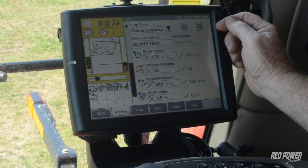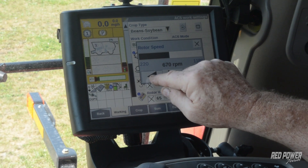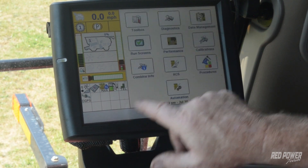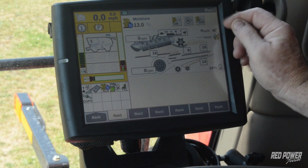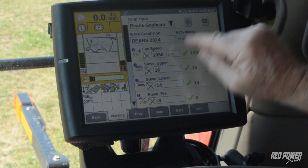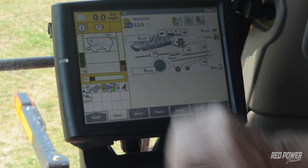This is our settings now for Beans 2024 — every time we shut on and off, this is what it's going to go to. Let's say as we're harvesting along we've decided we've got plenty of rotor speed and we slow it down a little bit — we may want to save that change too. On our run screens there are shortcut buttons up here that if we change something on a setting while harvesting, we can save it right there. This will let us look at what we've currently got and then we can hit the green check mark. That's our automatic crop settings. If we want to get back to the run screen, we hit that and we're back.